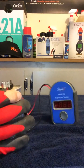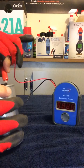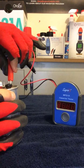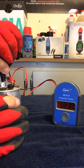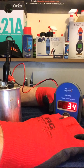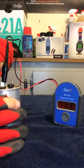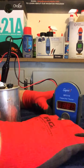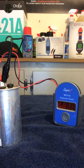Let's check this 70 UF. We're going to hook this one to fan and then hook the other connector to common. The wires are cold here — it's cold here in Phoenix. Ready? 3.4. It's weak — this is a weak one. Let's check the compressor side; this should be running around 70 like the other one was. It's reading 59. This capacitor is starting to go bad.